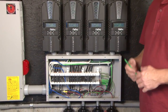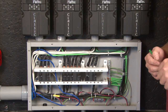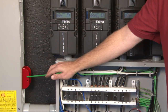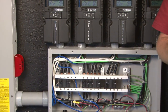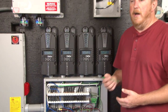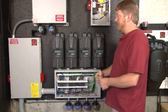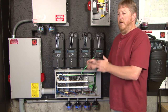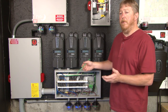I want to talk a little bit about best practice. This system is getting quite large in its charging and inverter capability. What I've done here is I've used the MNDC-15 and brought it into a junction box with its own breaker, and I've run that to the battery box all on its own — so it's not hooked to the same terminals in the ePanel as your inverters would be. This is important on large systems. As you grow these systems, if you get into 10, 20, or 30 controllers, it's really important to have good battery cables of their own to keep them isolated from the surges from the inverter, and vice versa.